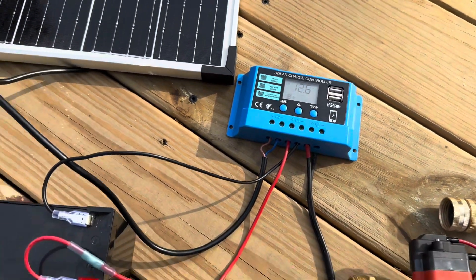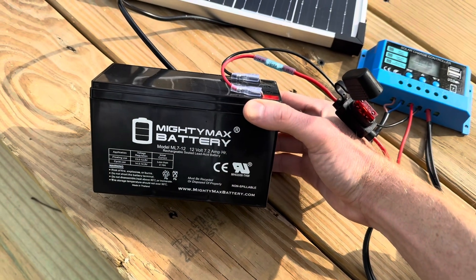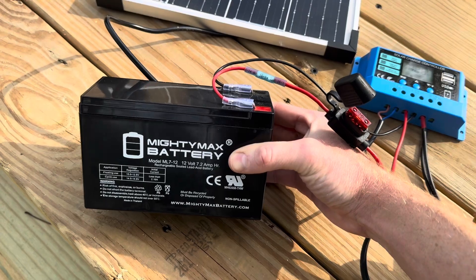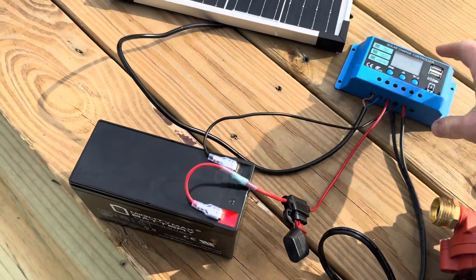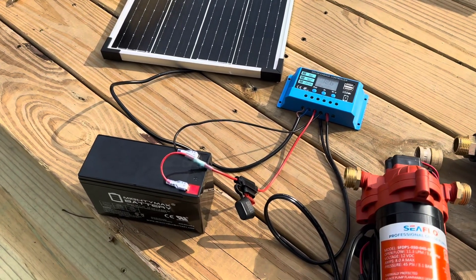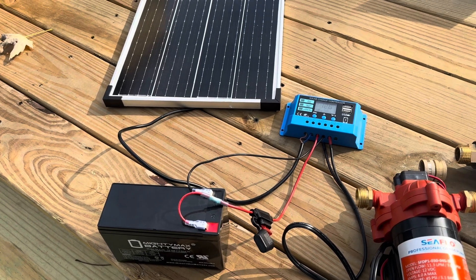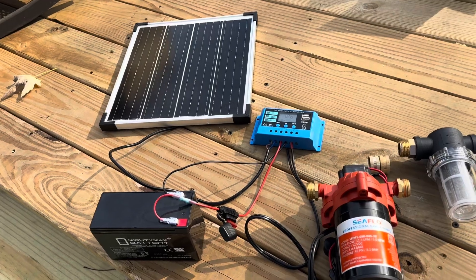So I've covered the solar panel terminal. For the battery, I've got these wires going to the battery — this is a sealed lead acid battery, like you might find in a deer feeder or something like that. It's a 12 volt, 7.2 amp hour battery. It's nice that it's sealed lead acid because it won't spill. By my math it will take about four to five hours for this 20 watt panel to charge this 7.2 amp hour battery. I'll show my math in the video description in case you want a bigger panel or have a bigger battery — you can adjust it for your specific case.